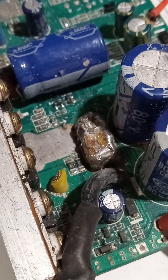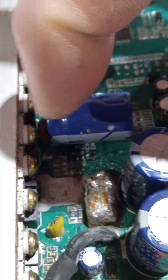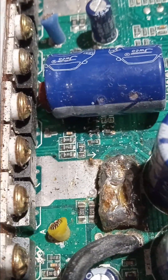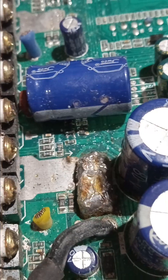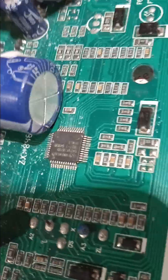I beefed that shunt up with a whole bunch of solder and it made a big difference — that thing's a neck-jerker when you've got 72 volts on it. I rode it around for a while but then had a problem with it. The shunt mod is simple to do, but you need to be really careful not to drop solder on any other area. You will kill the board immediately if you knock one of those little capacitors or resistors off — those are SMD, surface mount devices. Very touchy stuff, and good luck getting those back on if you're a novice solderer.